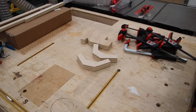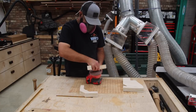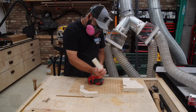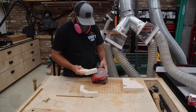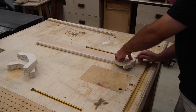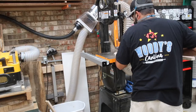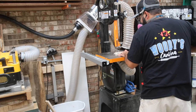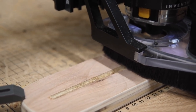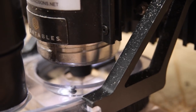All that's glued up. I have the main bracket piece that I'll attach to the table saw, an arm, and these two hose brackets that I'm sanding here — just taking off the sharp edges and corners. I'm also using a couple of my router templates that I cut on the CNC to draw out some curved areas. On the main arm I cut out the back side with a rounded curve, and on the other side I cut the inverse so the hose has something to rest in.